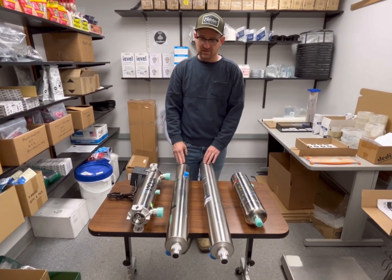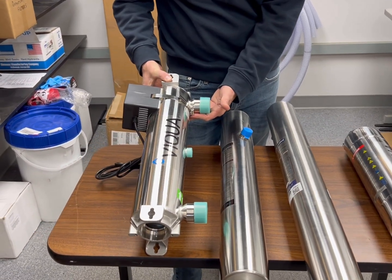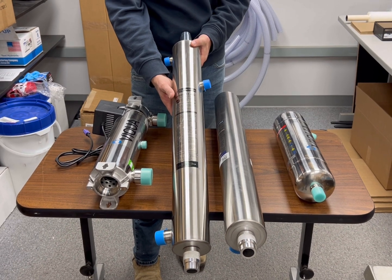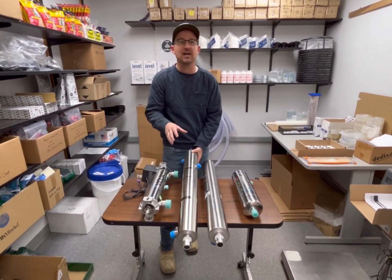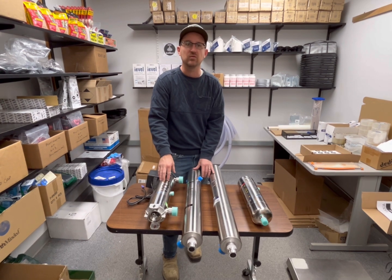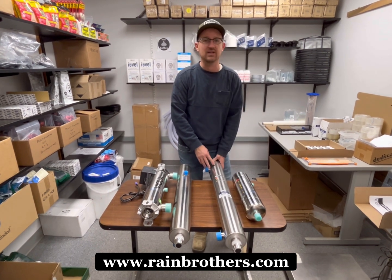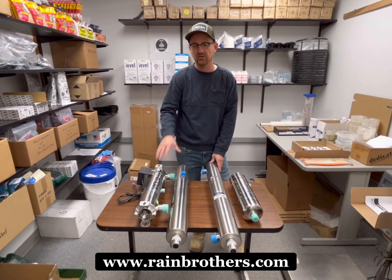The more expensive UV systems are what are called NSF Class A UV systems — such as the Viqua Pro 10 or the UV Dynamics Model 11.40C. NSF Class A means it's certified to sterilize any bacteria that passes through the water system for sole bacteria control. You don't need any additional bacteria control — you can rely solely on UV to purify your water. A system that is not NSF Class A certified technically cannot make that same claim, because it hasn't been tested to the same rigorous standards.